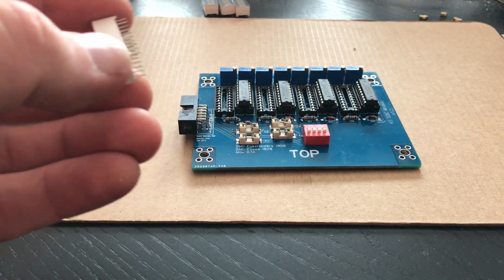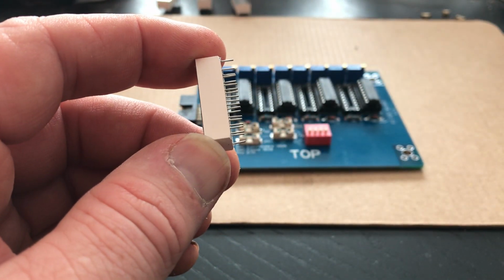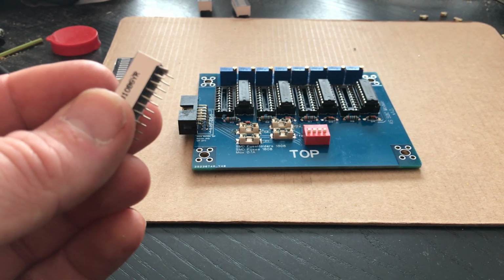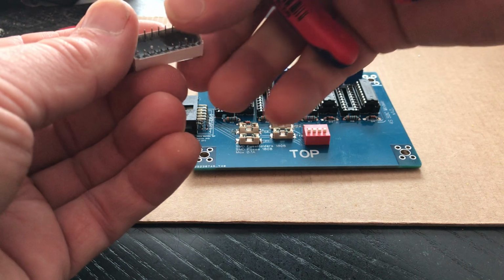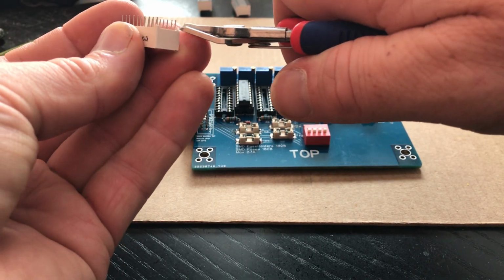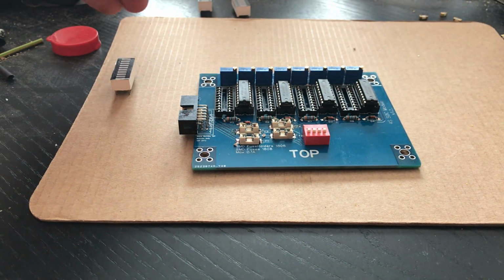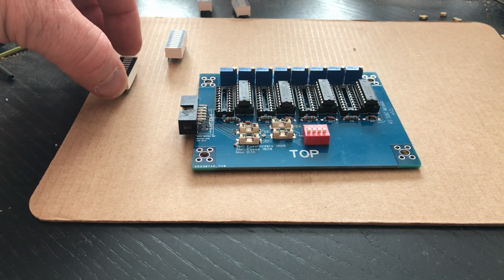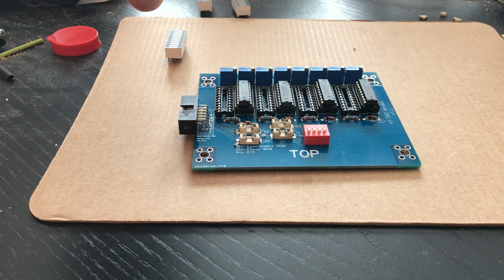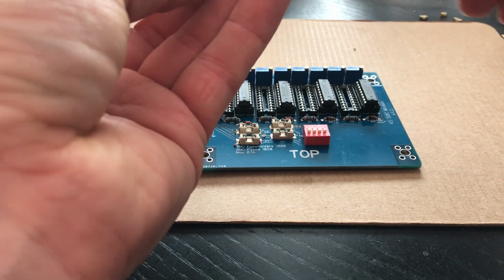Now we're gonna take the LED BarGraph, which I showed you in the previous video. This one is with the corners cut off. These ones still have the corners in place, as you can see. So again, same story, cut them out. Watch out you don't cut away one of the legs, but this is only necessary if you use the IC sockets and you want them to get deeper in there. So I prepare them, put the left side, the text, as you can see, the text on this one, because in this case the plus side is on the side of the text. Again, number 3, cut away the corner.